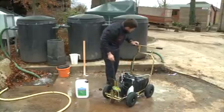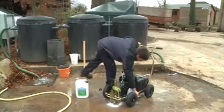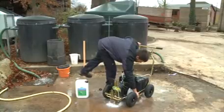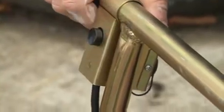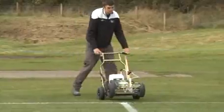The procedure for making the machine ready to apply paint is the same as with the Impact paint. The pump will first expel water into the pipeline, and when paint emerges, the on-off button is pressed to stop the paint flow. The line marking operation can now begin.